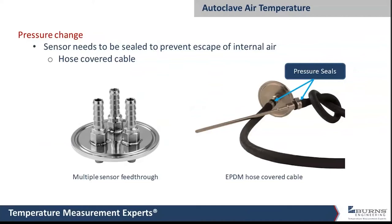Looking at the pressure change — if you take a regular RTD used in a typical industrial application with an epoxy seal, and put that in a vacuum chamber, the vacuum is going to suck all the air out of the inside of the probe, going right past that epoxy seal, because most are not vacuum tight. In an autoclave, you pull a vacuum and then put steam in. As soon as it comes back up to atmospheric pressure or higher, steam goes right inside the probe. That moisture causes shunting between the lead layers or on the sensing element itself, causing a lower than actual temperature indication. So it's very important to keep moisture out of the probes.